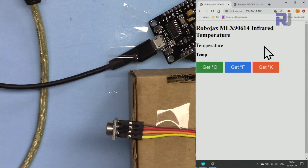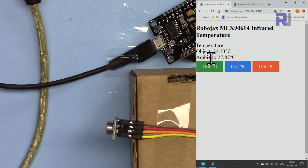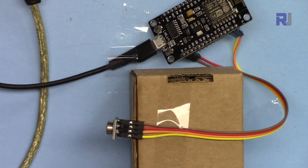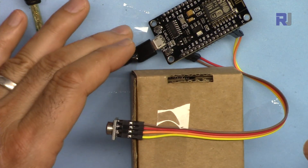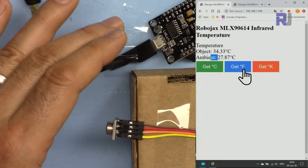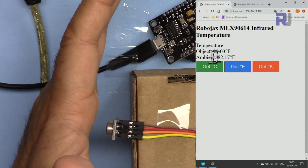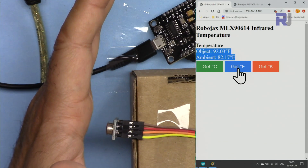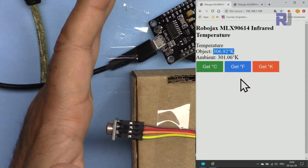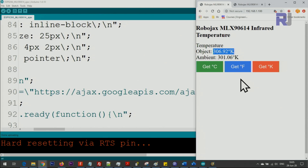In the browser you'll see something like this — when you press the button it gives you the temperature. It can measure your hand temperature and also the ambient temperature. You can get readings in Fahrenheit and other units. Importantly, I'm implementing this in two ways. One uses Ajax, meaning the page is not being reloaded — when you press the button it reads the temperature without refreshing the whole page; only the relevant portion is updated.